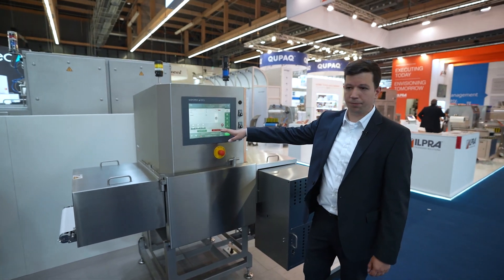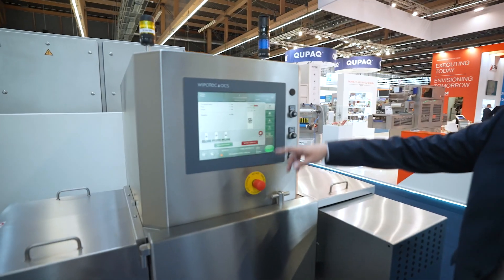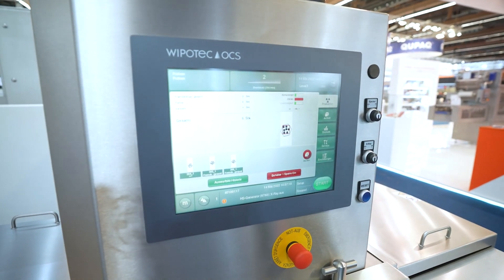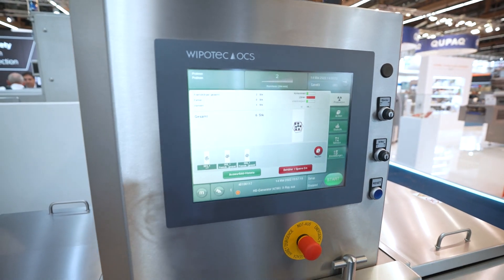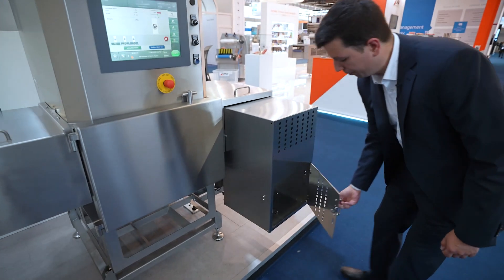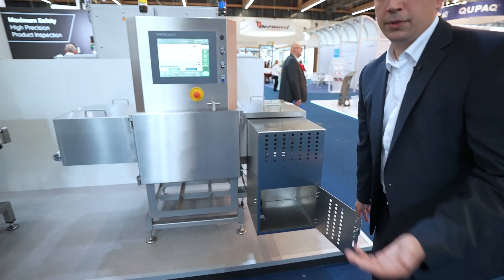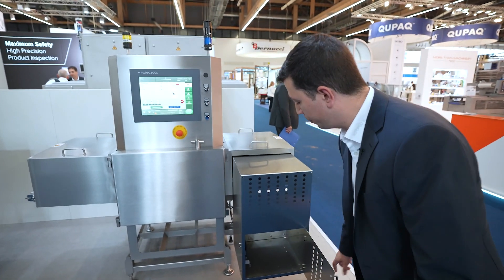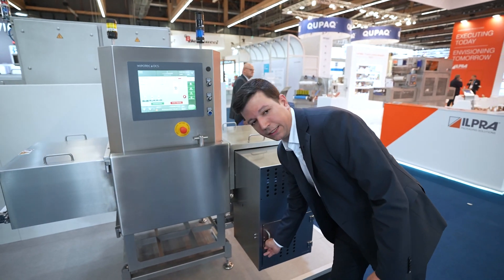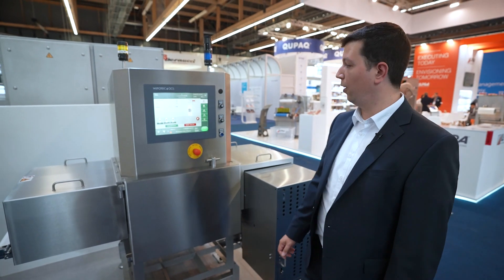We're starting with the screen. With the Marks & Spencer specifications we have separate levels regarding the users of the machine. Here we are at level 3, so what we can do is open up the rejection bin, for example. Let's say you are a quality engineer — you just pick out your example, close it back up and then it gets re-locked. Everything gets locked in the HMI so you can control it later on.